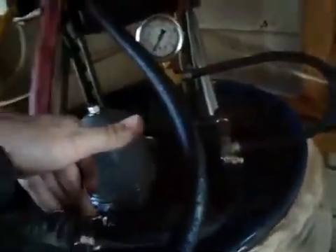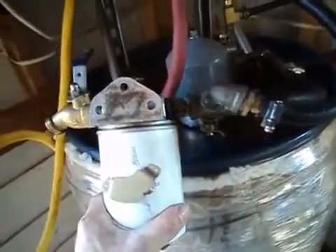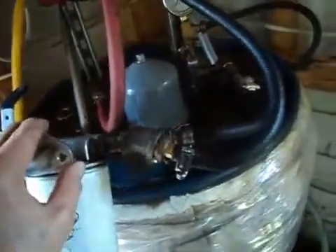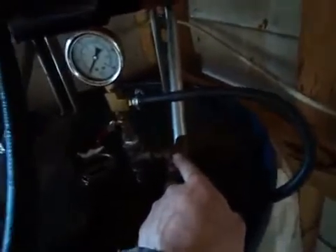After it's all good and done, whenever you're ready for oil, you can go ahead and shut this valve off, shutting the oil off to the centrifuge. Come over here, turn this on, run the bypass, get the pump running, and hook up a garden hose or whatever you want here. It's just a standard automotive filter — I think it goes down to 15 microns. I've got a couple of rare earth magnets stuck to it in case you get any metal particulates. Open your valve to your vehicle, pop it open, close this valve, and you'll get pressure out to your vehicle. You have the option of putting a valve at the end of your hose, and once you close it, this bypass safety valve will pop open once PSI builds up so you can walk over from your vehicle and shut everything down.